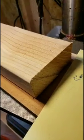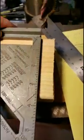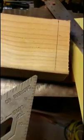Here, I'll actually show you that in a video. So here's an example. See, I don't really care for this end. I want to get away from this end a little bit. So I'm going to cut mine further in. I'm going to start here somewhere, right? So watch what I'm going to do. Okay, see, I made a mark, and I put my square on it, right there. And I got it exactly on that mark, and then I drew my line. Now that mark, that's a 90-degree line, so that's all the way across. That's there, so it doesn't matter about this end. This end can be whatever it wants to be. This line is true to that side over there. Now I'm going to measure 12 millimeters from here over to here, and then draw a line from that corner to this corner, and that will be a 7-degree line once it's cut.